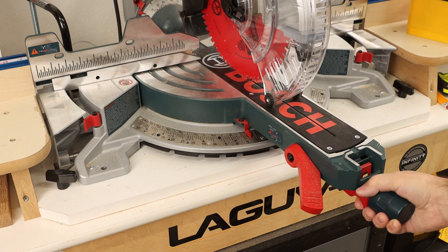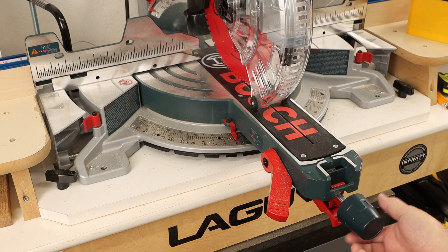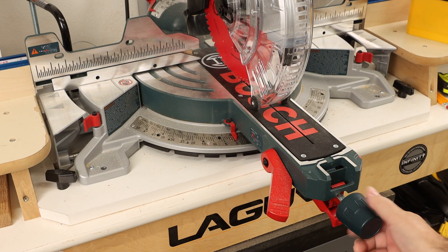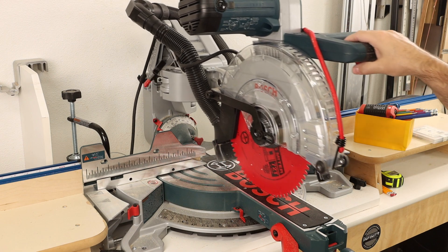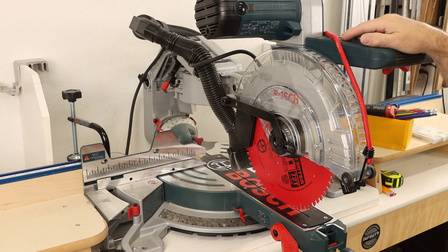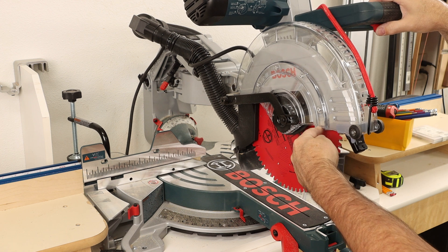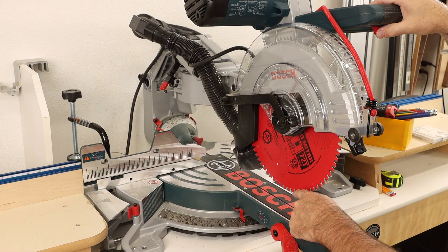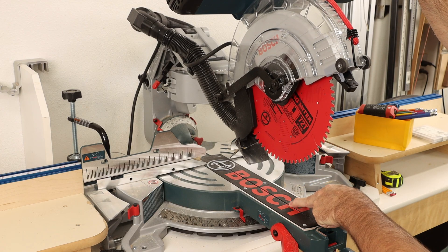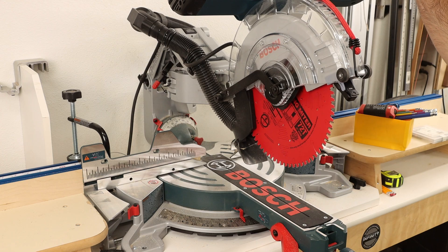There are actually two different ways that you can have slop on this saw. One is related to the miter detent system — as it falls into the detent at zero degrees, before you've locked up the knob there shouldn't be any side-to-side play. The other type of slop is the whole cut deviating left or right, which can be due to looseness in the linkage. With the saw unplugged and the blade guard retracted, if you give a fair amount of lateral pressure you shouldn't see much more than about a 64th of an inch deflection at the blade.